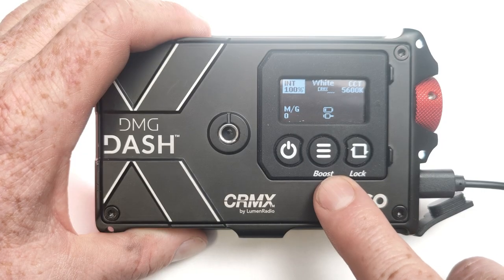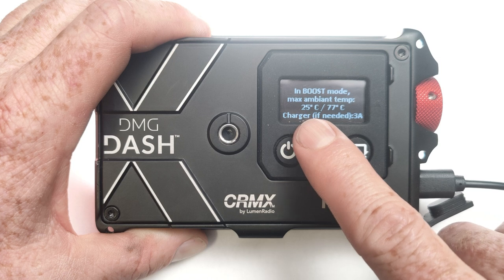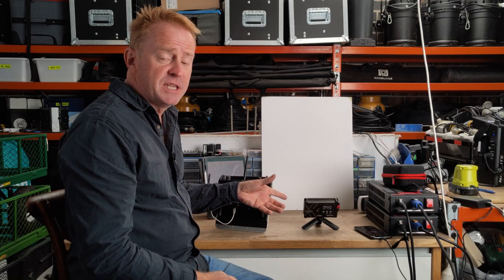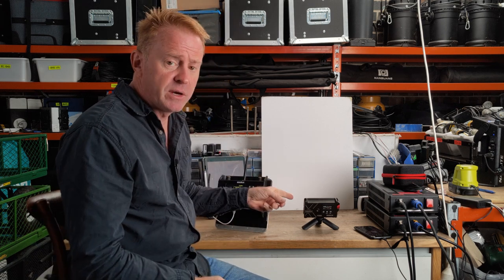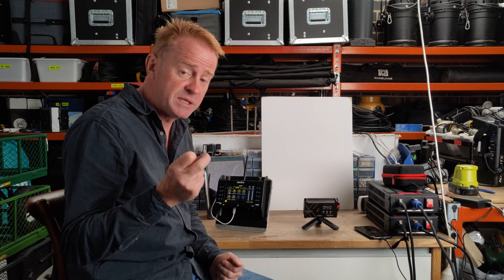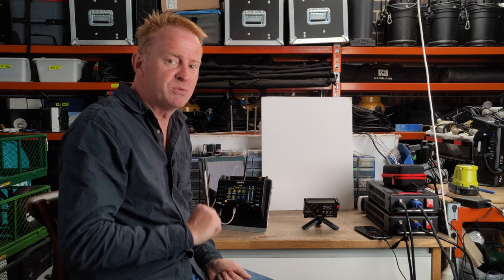The light does have a boost mode. To get into boost mode, hold the button down for three seconds and it will display your parameters. The maximum operating temperature is 25 degrees Celsius and boost mode gives you an extra 25% power. Now let's have a look at how this thing responds to Lumen Radio or CRMX. If commands are very slow and steppy, you need to go into the menu and turn off the Bluetooth, because the Bluetooth transceiver interferes with the CRMX receiver. Turn off the Bluetooth and you'll have a much smoother ride.